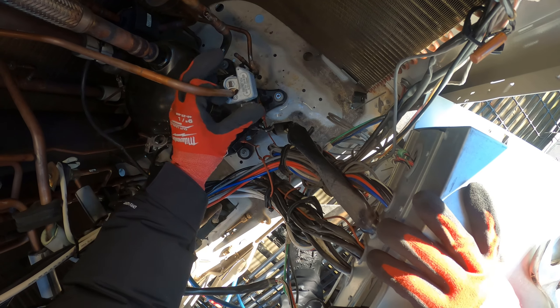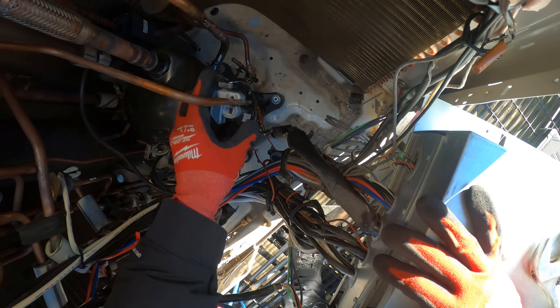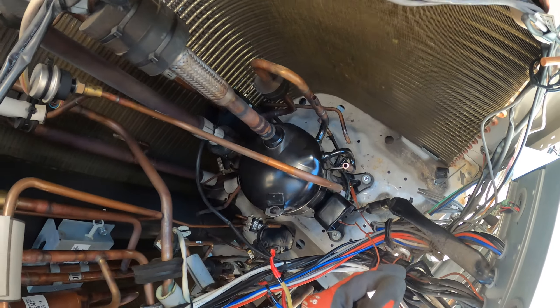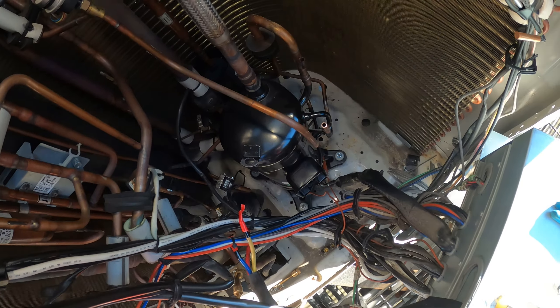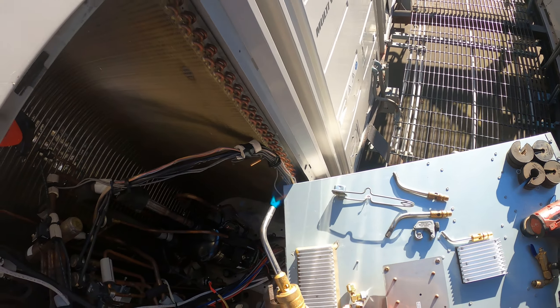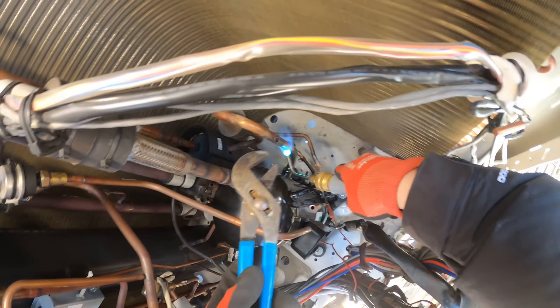I got this whole thing set up right here. I think if I could just cut these smaller pipes, that would be awesome — last thing I want is oxidation in the pipes clogging us up. Right now I got these two pins, the Schrader valves out here, and if I just open up the nitro I can see it coming out both sides — so that's good. Whatever I have flexibility with, the smaller pipes, I'm just going to cut them out. They're small and bendable. Now I just got to take out this one and this one — we're going to unbraze that one, run some nitro through it so we don't oxidize.